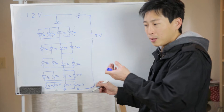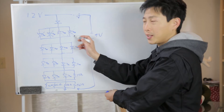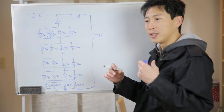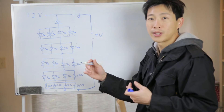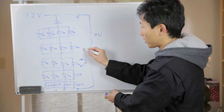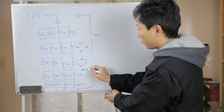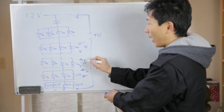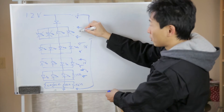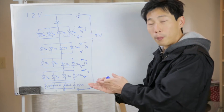In order to debug this, all you have to do is take the module out, put a 9-volt battery across it, and then measure across each LED to see how much voltage there is. If there's a really large voltage it means it's shorted open. You might measure like 1 volt across the good ones, and then when you go to the broken set it's going to show maybe 5 volts or something — so that lets you know that one is shorted open.